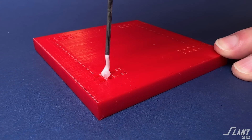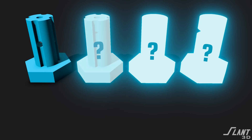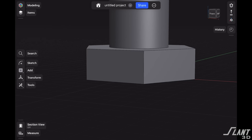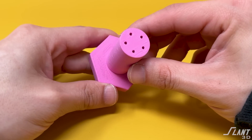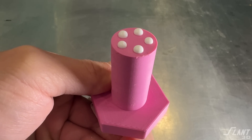The glue you put in here has an additional benefit. Usually glue is just to stick one part to another, but 3D printed pieces have a certain strength reduction in the z-axis — the part could snap along that direction. You can use this glue slot methodology to reinforce the part like rebar inside concrete. You create a single entry point and a splitting chamber inside the head of the bolt that splits down to five separate columns, running lines of glue through the center of the part. After placement, you shoot glue in and the part is reinforced with much more perpendicular strength than a traditional 3D printed part.